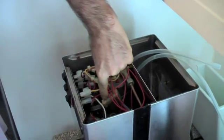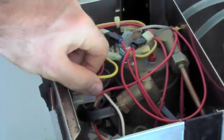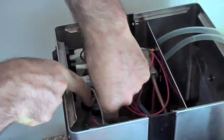There's the pressure relief valve right there, and you probably want to disconnect these two electric leads to get them out of the way. The hose here leads back to the reservoir tank, so when the pressure relief triggers, the water goes back into the tank. You take a pair of pliers, press that little clip down, and that'll get it off so you can move it down a little ways.